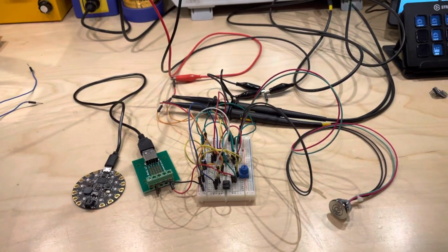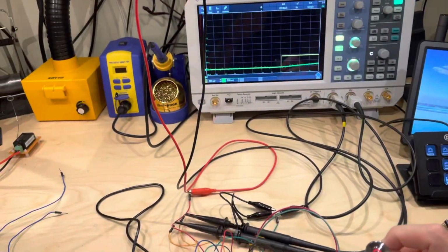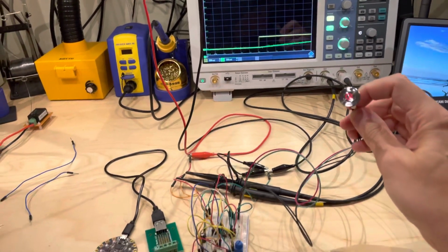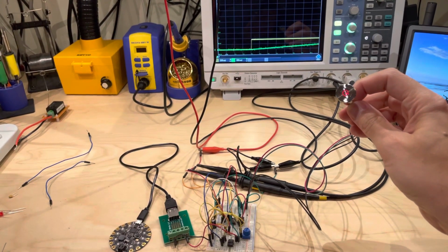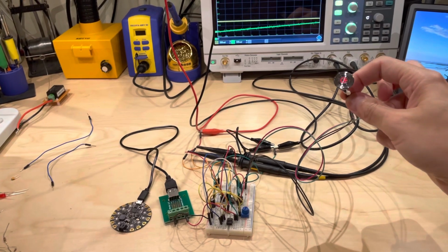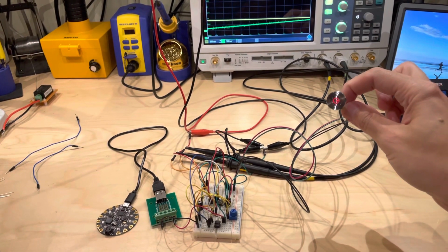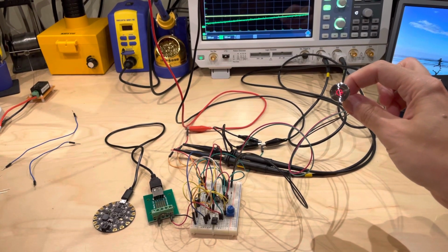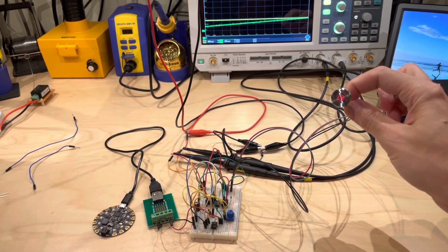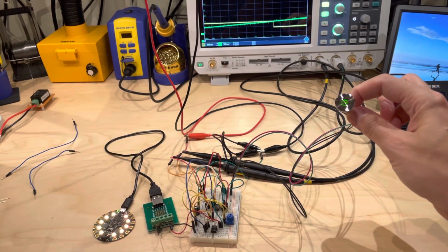But the other thing that we'll see this time, so when I turn this on, I get a red light here, and that's doing its charge up thing. And when that green reaches the yellow on the oscilloscope, the device should come on, and this should also switch from the red LED to the green LED. Hopefully everything will go as planned. Voila. Oh, that's kind of cool.